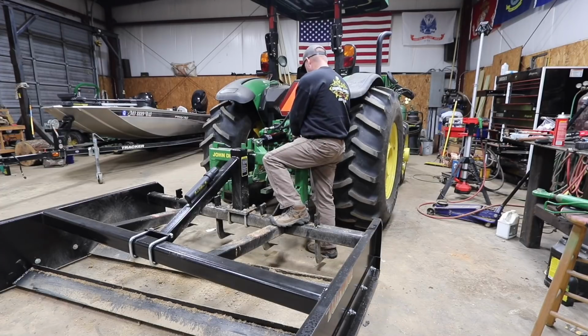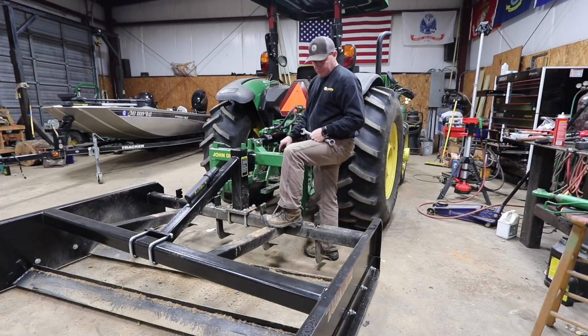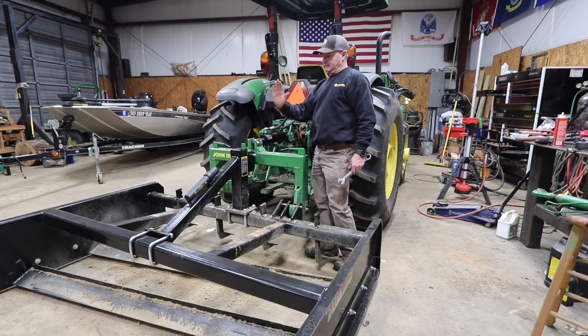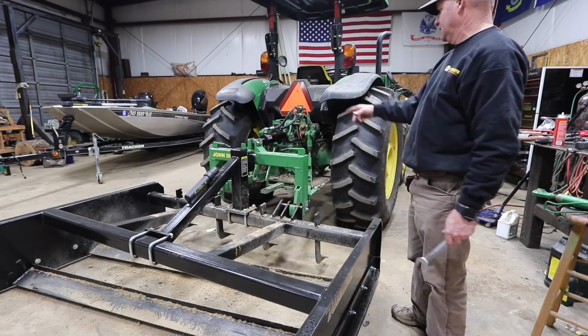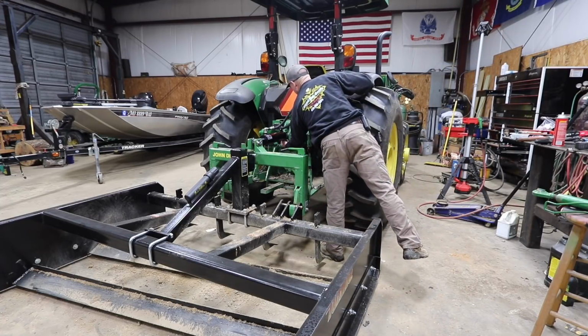I've seen a lot of them over the years. They got too much line on them. It's going to be real good with this blade on here or any other blade as far as that goes. And the bush hog too, the top link works really good on a bush hog because you can take that bush hog, say you're riding brush down with it, lift that back all the way up where you can get up with a good angle on it, back up to it and then ease it down on it. Works really good, but they really shine on blades, and you can just adjust them on the go up there.